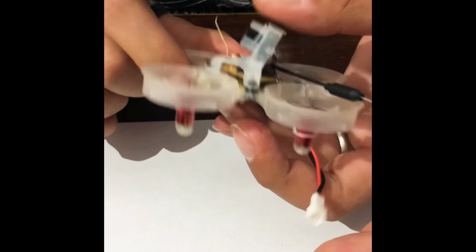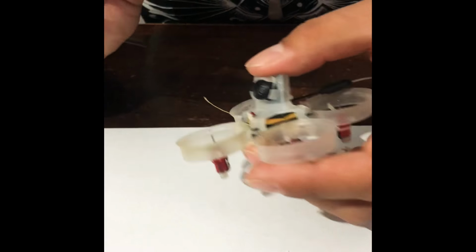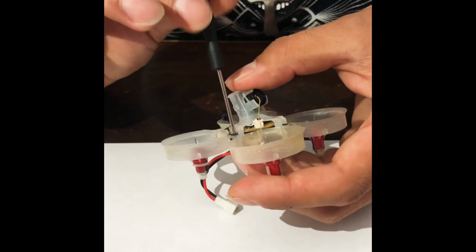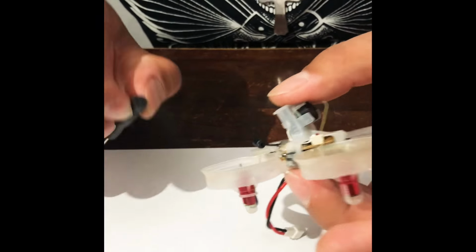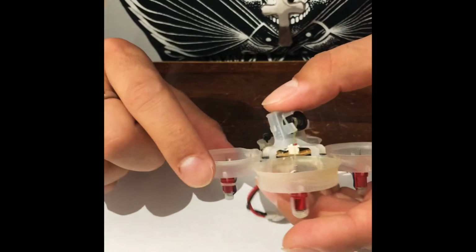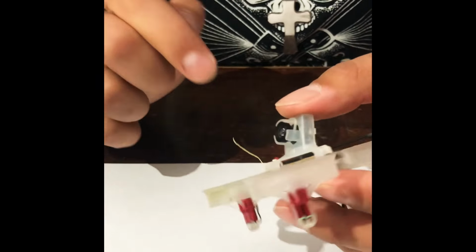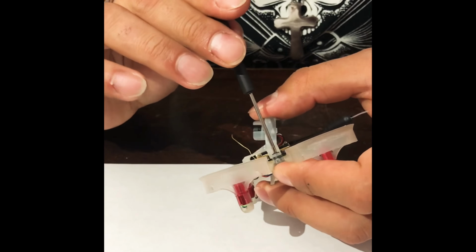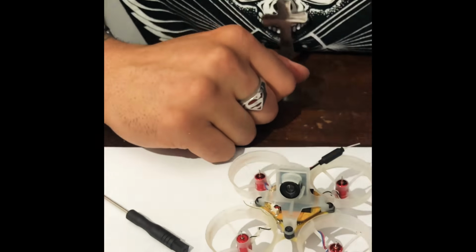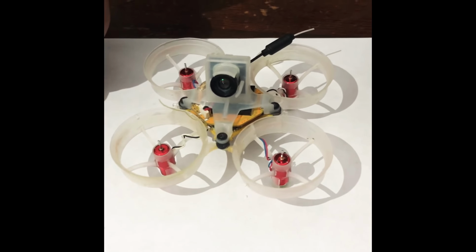Then I received the part. I was gonna make a video for you guys. I actually was making the video and all excited, and then bam, it happens that the all-in-one I bought from Maytech, I got it through Amazon, had a bad MOSFET, a loose MOSFET, and when I soldered the power on, it won't even power on nothing. So I gotta mail that back. That's a good thing about Amazon. They'll refund your money and get you going.